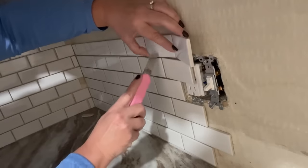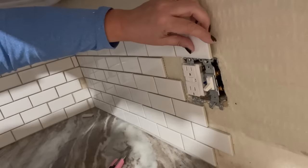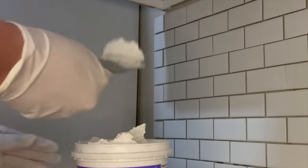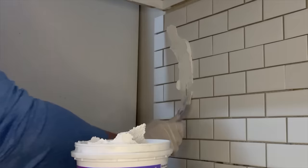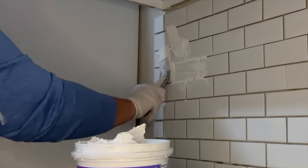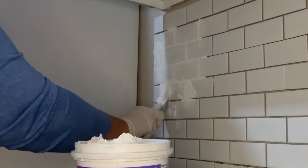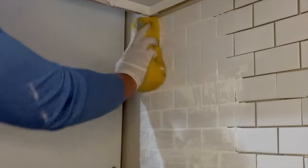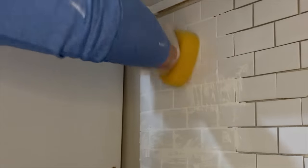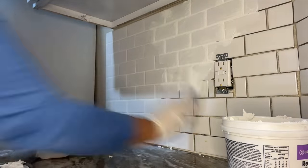When I got to the outlet and light switch area, I pressed the tile into place lightly and then cut away the tile, making sure only to cut the mosaic tile netting and not the adhesive on the wall — I needed that adhesive to stay so I could cut tiles down to size and install them around the opening. Since there's no downtime with this method, I was ready to grout right away. I used a plastic putty knife instead of a grout float, which I find difficult to maneuver. It's not the traditionally recommended way, but it worked well for getting grout into the spaces.